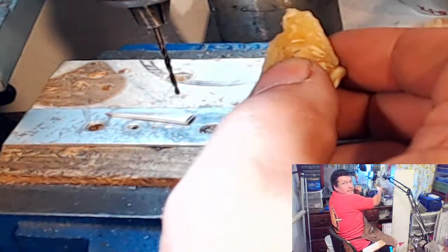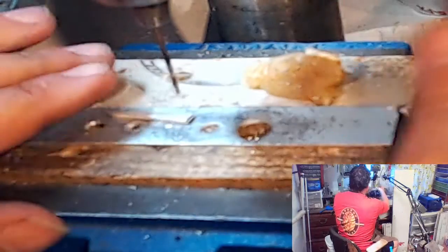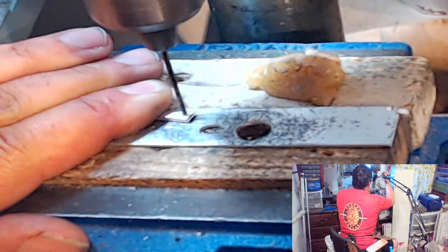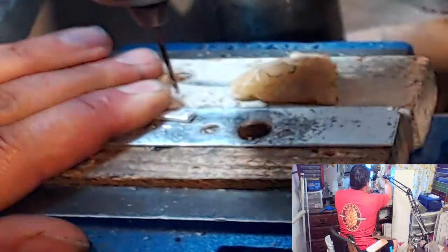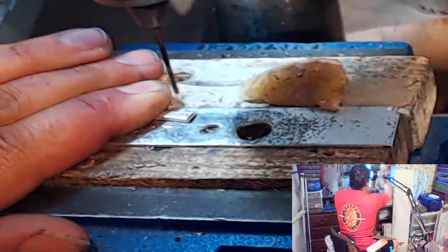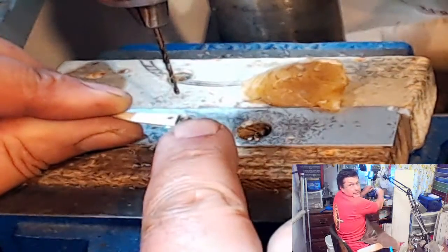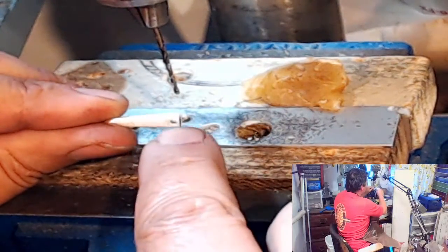I've got my beeswax. I like to hold my finger as close as I can without getting it too hot. Line up my mark so I've got it started. Just a nice easy hold down. Once you start feeling it not go down as fast, go ahead and wax it up. You can go a lot faster, but the faster you go the harder it is and the hotter it gets. So on here you can see there's a little bit of flash - we're going to take that off in the next step. But we have a nice clean hole.